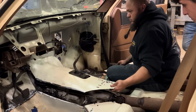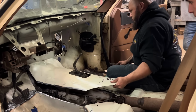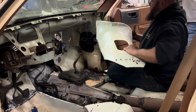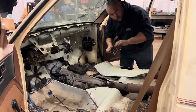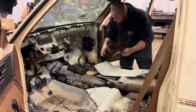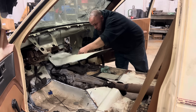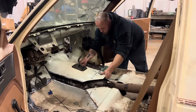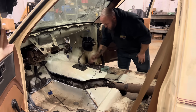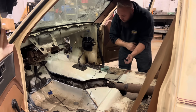So, cut that whole lip off. Pretty much. All right, let's go cut some stuff. All right, so we cut the lip off the front of this transmission tunnel. That's where the spot welds was. I drilled all that out. I was planning on spot welding the back, but I think I'm just going to butt weld it. Beautiful. And we're going to grind this weld across there, take a hammer, beat it around, start filling it in. What's that side look like? Straight, pretty much straight down? Yeah.